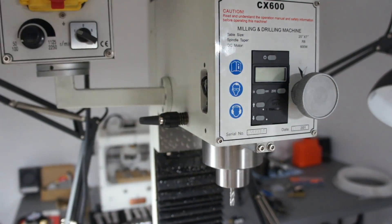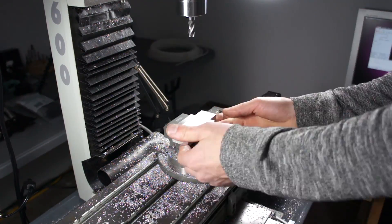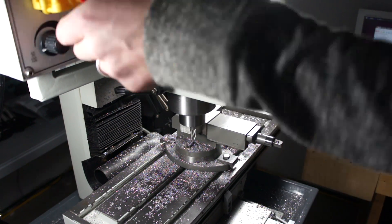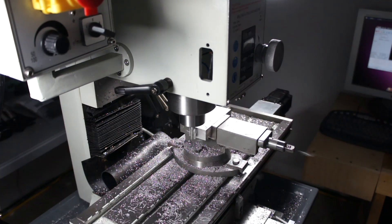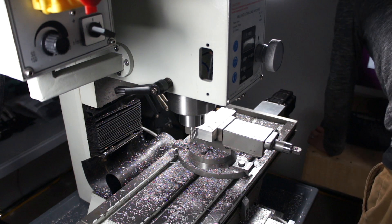There's loads of room and nothing sharp inside, so it should be just fine. Next step is to build a mounting block for the little air fittings. What I did here is put a piece of rough-cut aluminum on the CNC mill and in kind of a manual fashion I'm just going to clean up one edge, take some offsets, do some measurements, and basically get the stock to the size I wanted.